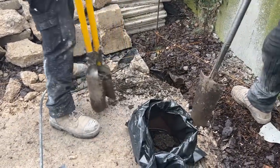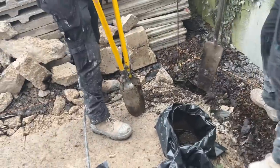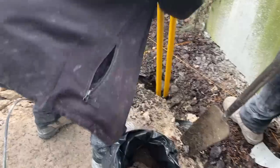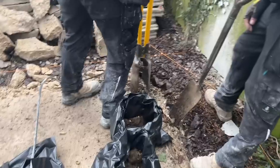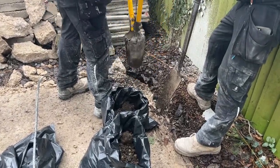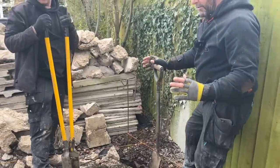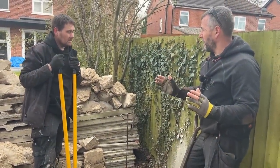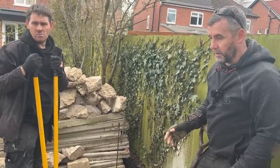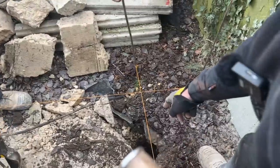Francis McNamara asks: building with blocks and filling with concrete on a building roughly five by three — how many pillars would be needed? I would put four pillars on the front, four on the back, four down the middle, and three on each side — very much like the rod system. Your breeze block gives you quite a lot of timber sat on it, so you'd need fewer than with the rods. But you want a damp course under it. Now, looking down there — the hole is in line with that string line, and we're not at depth yet.